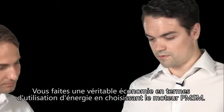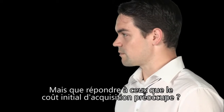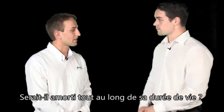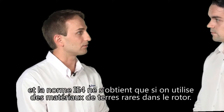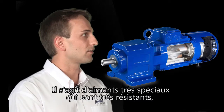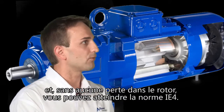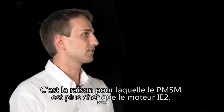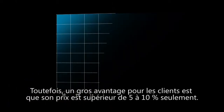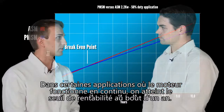So you're making a definite saving in terms of energy use by going for the PMSM motor. But what would you say if people were concerned about the initial procurement cost — would it pay for itself over the course of its lifetime? Usually the PMSM motor in IE4 requires rare earth materials in the rotor. These are very special magnets — they are very strong, and you don't have any losses in the rotor. This is the reason why the PMSM is more expensive than the IE2 motor, but the motor is only more expensive by about 5 to 10%. The break-even point can be reached more quickly when you have applications that run continuously.